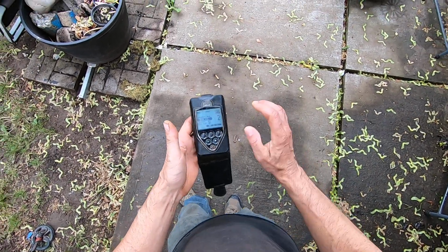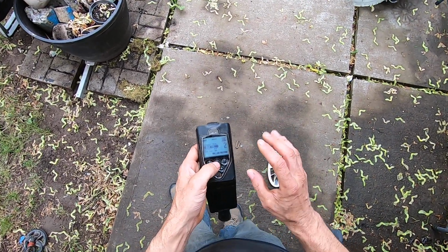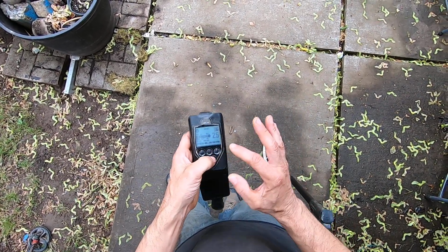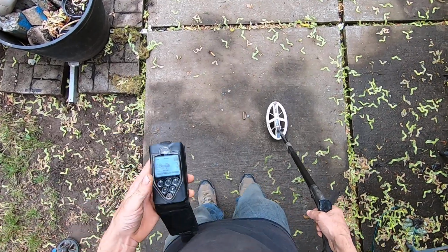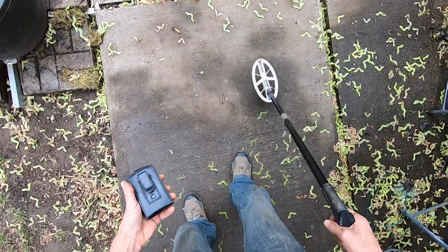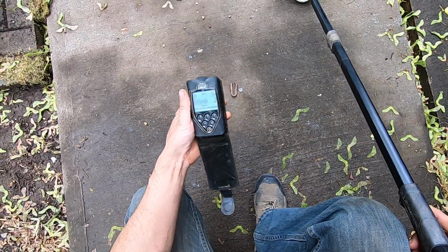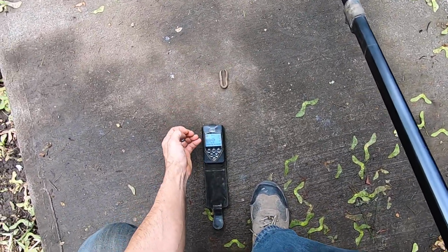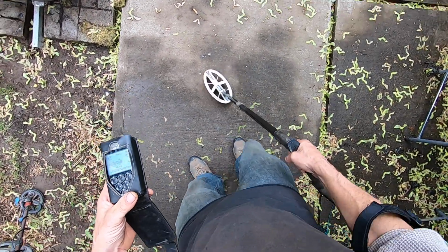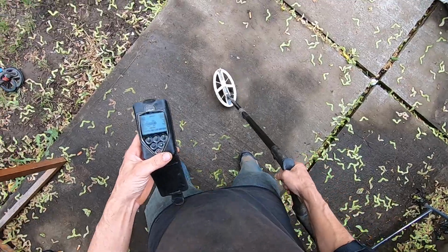And since I adjusted my iron volume there, I have to do one more thing. I have to raise my recovery speed, which is my reactivity speed, up to 3, right? Now it'll hit it really good. Look at that. All the iron just went away. It's still in the same program. I'll take this out of there and it's not falsing on it, right?